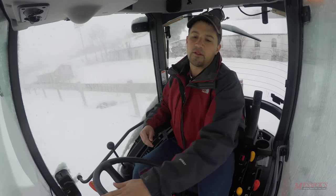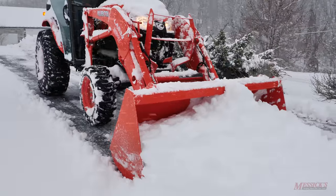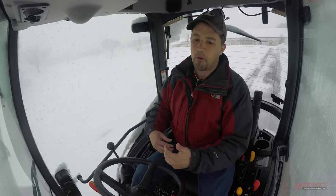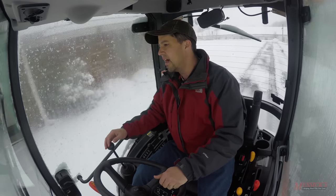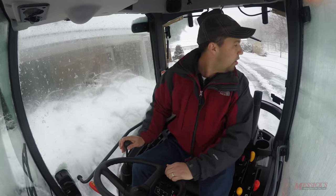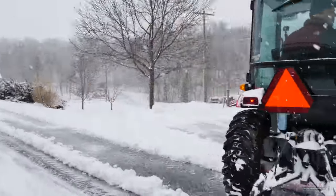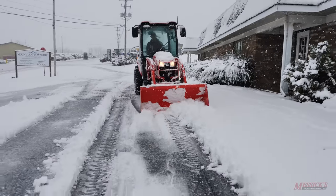If you've got a pretty significant snowstorm — like 12 or 18 inches — bucketing snow like this isn't the most efficient way to do it. When you get a pile in front of yourself and sweep it off, long runs start to take a lot of work, and cleaning up all the little dribbles that come off the sides of your bucket could take some time. There are attachments that can do snow more efficiently. With a skid loader coupler on your front loader, they make a really slick small Land Pride push box. That push box does a great job of keeping the dribbles off the side and collecting a big pile of snow. They also put rubber or plastic edges on the bottom of those push boxes, which is really nice for not marring up the driveway around your home.